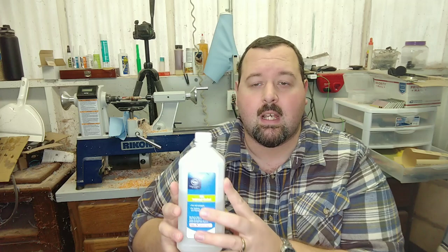So I figured I'd come out and do a demonstration on the differences, pros and cons for each one. First and foremost, isopropyl alcohol is a wonderful all-purpose alcohol. It does a lot of different things. For me out in the resin casting shop, anytime I spill any resin on my countertop surfaces, a little bit of isopropyl alcohol and a blue shop towel wipes it right off — scrub a little bit and it's as good as new. The resin comes right off with it.